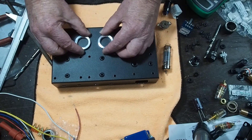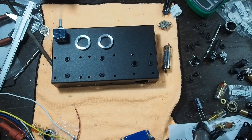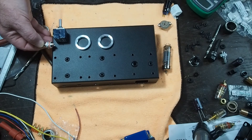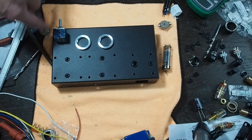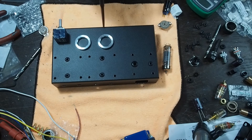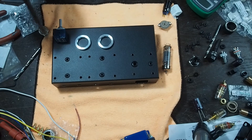That's enough space between them for them to cool. Then we can put our potentiometer down here on the end, and if we put our RCA jacks vertically on the side, there's a very short path between the RCA jack and the potentiometer — likely to the point where we don't even need to use shielded wire to connect them. Then we can run the heater windings up in the upper corner along this upper edge from the tube, run them around to where the filament voltage is, and they're nowhere near where the signal pathway is.